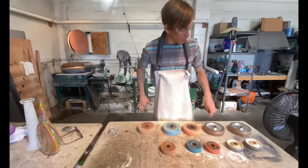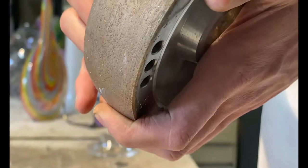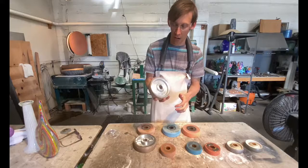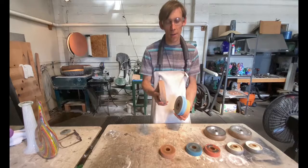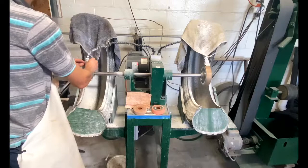I got these wheels on eBay — they're coming out of Eastern Europe as well. This is a 60 grit and it's really rough; it's called a sintered wheel. You can see how thick that brass is — that's how thick the diamond is — so these things will last forever. This is a 300 grit sintered as well. After that you go to the 600 orange, then the blue, then the brown for your final high polish. When starting out, you want a little water dripping on your diamond wheels to keep the glass cool and act as a lubricant.